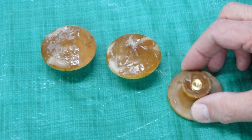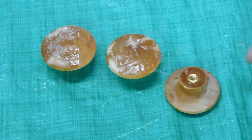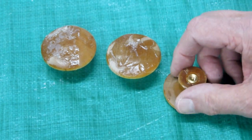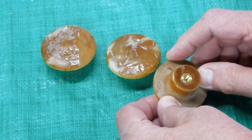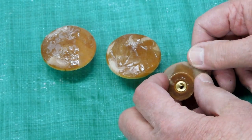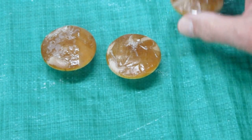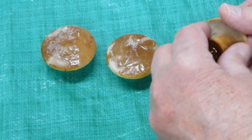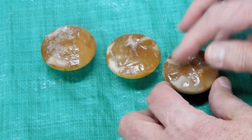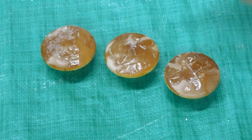These were in the resin with bubbles coming out for well over six hours under vacuum overnight. I released the vacuum this morning and it sat in there for another four or five hours before I took it out. These were super saturated with the resin — so much so that after I wiped them off dry, if I set one down and picked it up a minute later, the resin was oozing out of the wood and leaving a puddle. That's what you're seeing here — the resin that continued to come out of the wood after removal from the vacuum chamber.